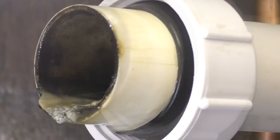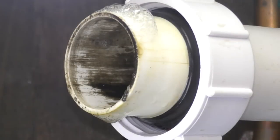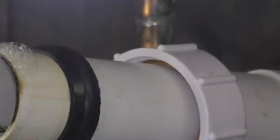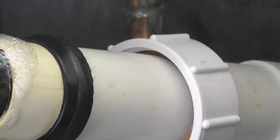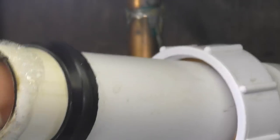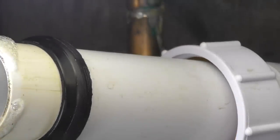The first thing I'm going to do is get a cloth and clean out this pipe. I made a bit of an error here — when I was doing the plumbing for this sink unit I used solvent-weld pipework on everything up to the bottle trap itself. That's a bit of an error because it means I can't now remove any of these pipes if the slime and sludge goes further down the system. But you live and learn. Next time I'd probably use push-fit piping much further down, not just at the top where the bottle trap is.